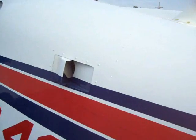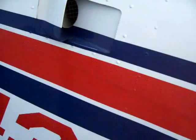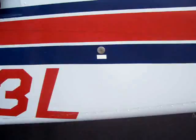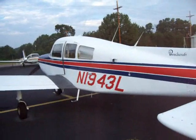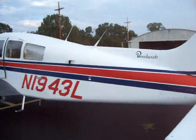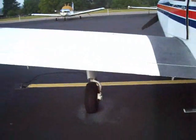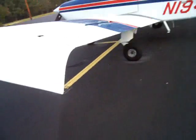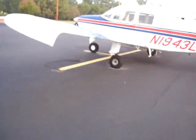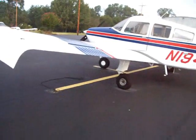Come around here. Static port — looks good, nothing's in there. I focus with my finger first, then pay attention to myself. I step back a little, look around — all the antennas look tight, everything looks good up there. In the back, I just take one big step back and get a good overview of the plane, make sure I don't miss anything. Everything looks good.